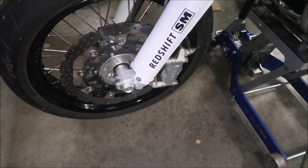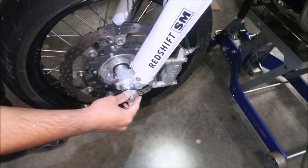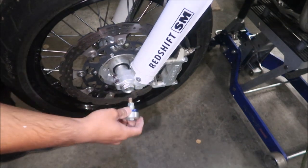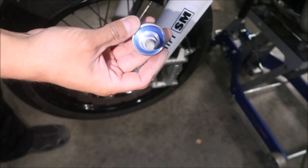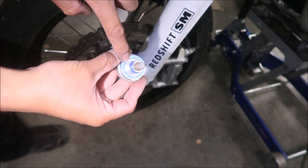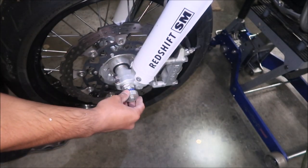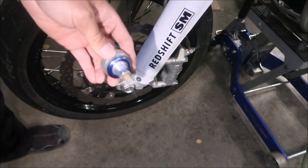I've turned it down to about 18mm but it's not small enough yet — going to keep going. Check it out — that's how much we've ground down, like two to three millimeters. All that non-blue stuff is what we've removed. I'll just keep cutting a little bit at a time and fitting it in there. If it's a little bit loose, we can put tape around it.